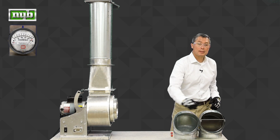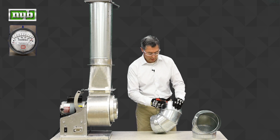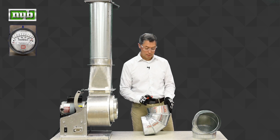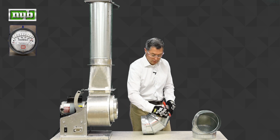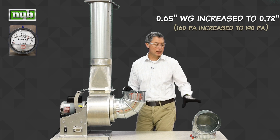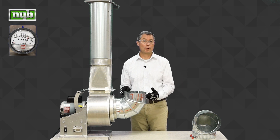We can correct that by breaking the section of ductwork into multiple pieces. Here we have a single vane. The vane cuts the duct in half — it bends like this — so now we have a top section of the duct and a bottom section. Functionally breaking it into two means air bends along the vane, so we can now load the mid-top section of the fan wheel with air from the top, and load the bottom section from the bottom. Putting this on the fan, you can see that performance still went down, but not as substantially as it did with the non-vaned elbow. Sound didn't go up as much either — it went up a little bit, but not nearly as dramatically. That's because we don't have as much turbulent flow going into the fan.